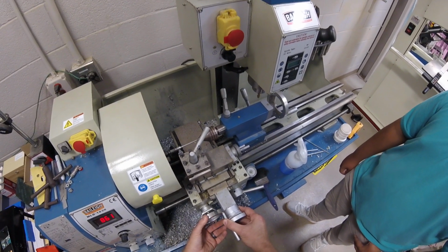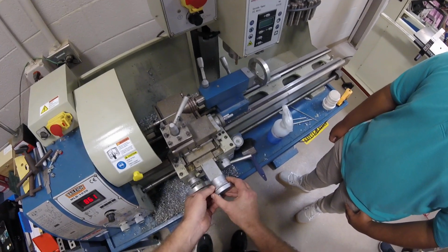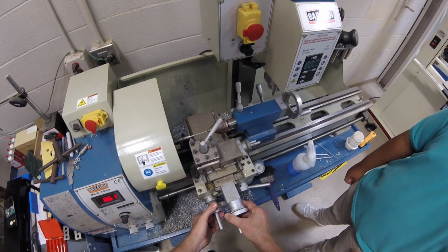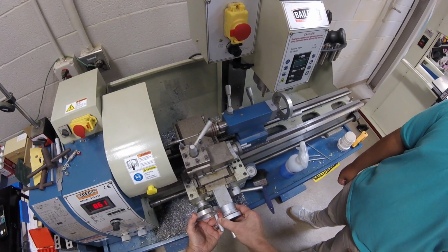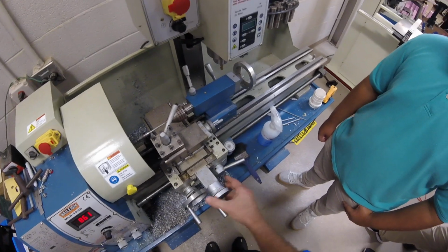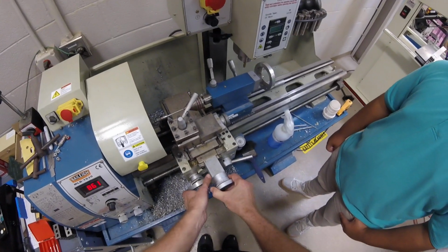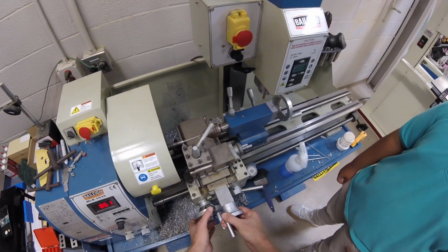After this one, we're going to go all the way down, but that second pass, you're going to go to 20 thou, right? I'm going to go ahead and finish my full cut before I come back, but I'm going to show you that now I'm coming down to 20 thou. So I'll make a pass right there. I'll finish all of those, and I'll come back and go further in to 30 thou, then 40, 50, and then 60. No matter where I am, I can come back and zero off. This machine's accurate and precise enough that I can come back and reset at 10, and I can continue these cuts.